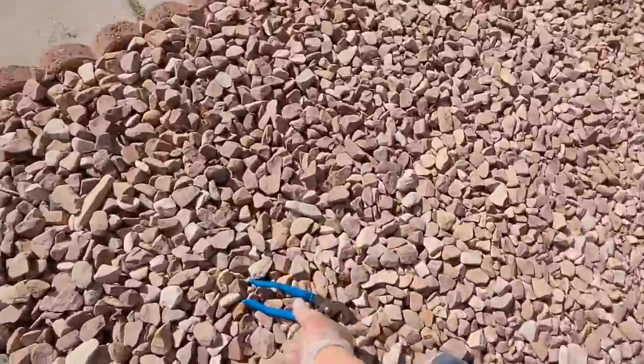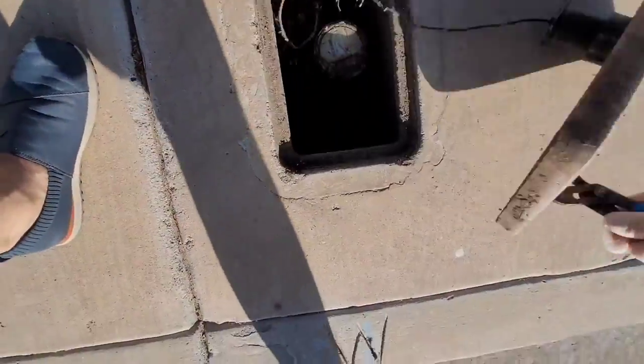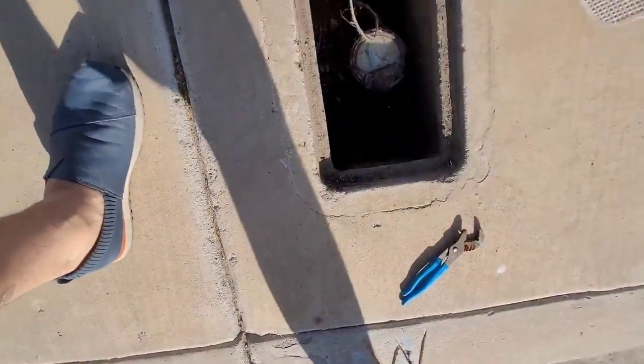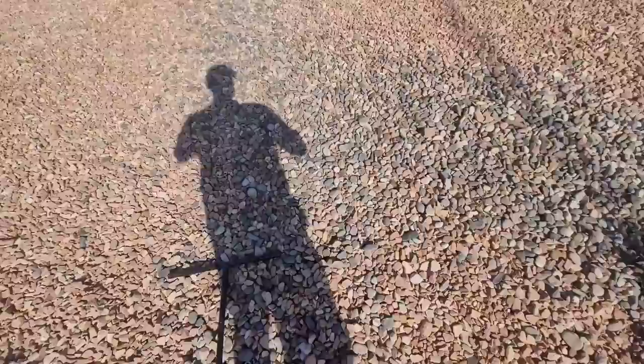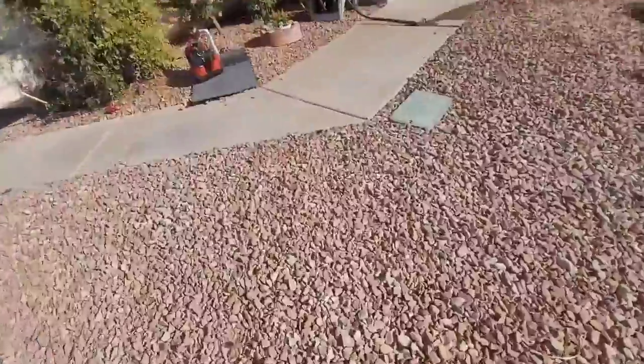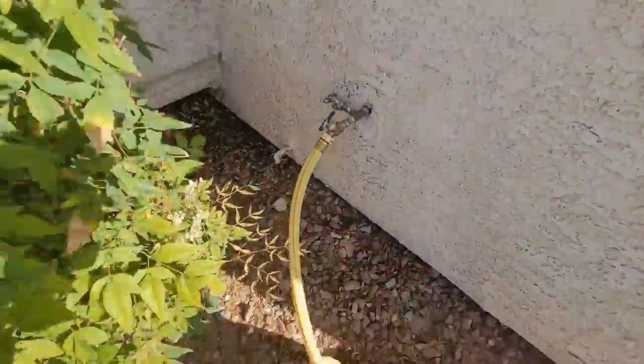We're gonna go turn the water on here. Always go slow when you turn your water back onto your house. It's 70 pounds per square inch, so it's like a freight train coming through your water pipes, and if you go too fast, you can compromise any weak spots. So go slow. I had the hose on, remember, so I turned it off.